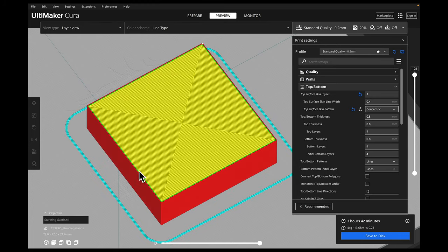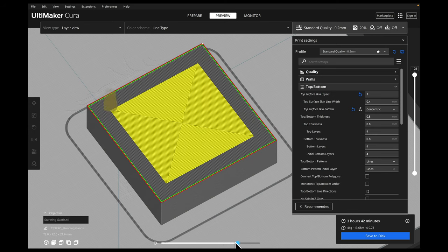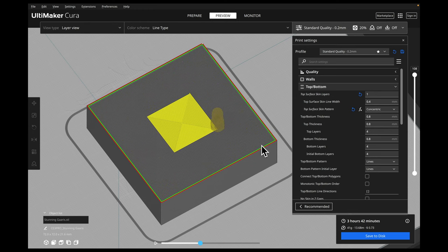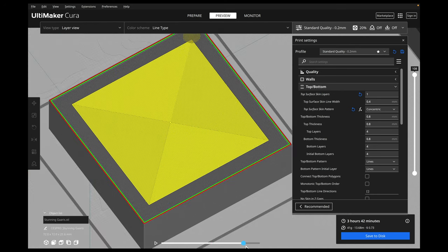Concentric is basically a circular pattern — or the perimeter of the actual print — for how it goes. Since this is a box, it basically just keeps making boxes that get smaller and smaller. You can see how it creates a nice pattern concentric to our actual model shape. Our very top layer is printing lines, and it's printing the skin concentric pattern on top of our last top layer. So if you have more organic prints that are circular or rounded, concentric is a nice top skin layer pattern because you don't see those lines — you actually just see the shape building up. Sometimes I like to switch to concentric for my top skin layer.